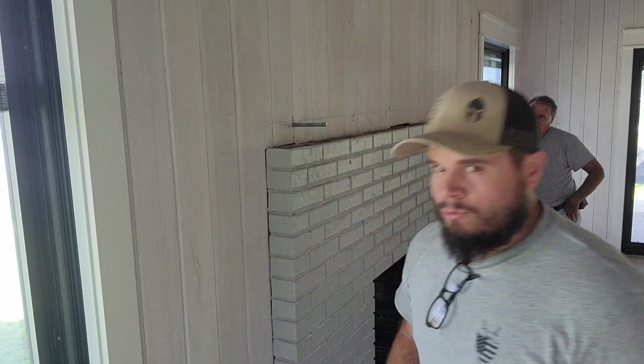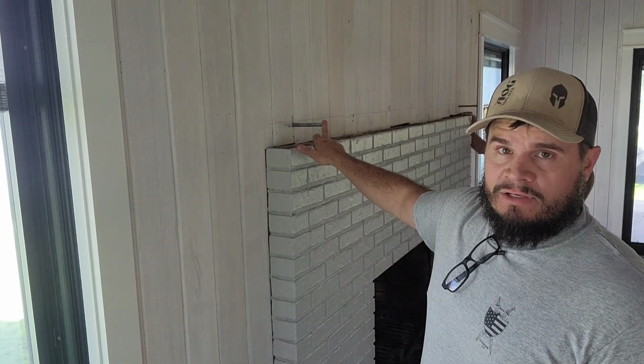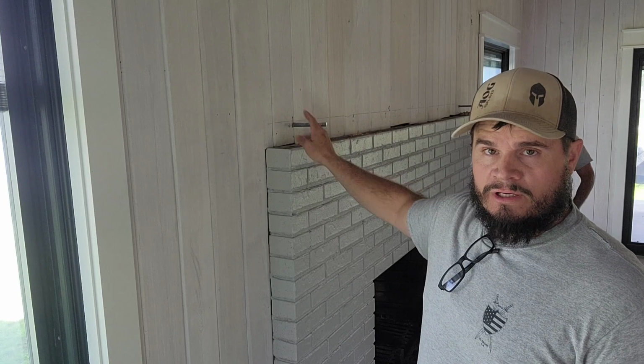But we use 1/2-inch by 10. We put our 3/4-inch hole in there, and that gives me somewhere for all that epoxy that we're gonna put inside that hole to expand. So what we do is we measure from the wall out 5 inches. And so we cut the head off with an angle grinder and a cutoff wheel.